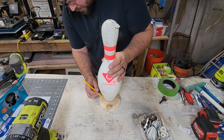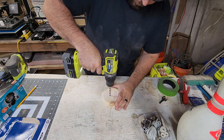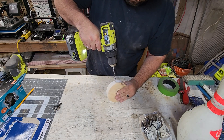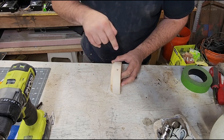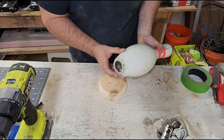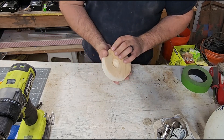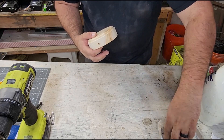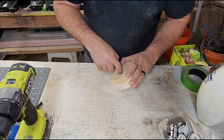It's time to drill some holes. I've got this centered and what I'm going to do is just mark all the way around here — this is going to give me a good basis of where I need to drill my holes. The wire is going to come in here, then come in here where we'll actually tie a knot in it, and then we'll run it up through here. It'll go through the bowling pin up to the top where the socket will be, and then that is our lamp. The reason you need to know this is because you have to prevent the wire from being pulled so it doesn't actually pull out of the connections, which creates a loose connection — electrical shock and fire prevention.